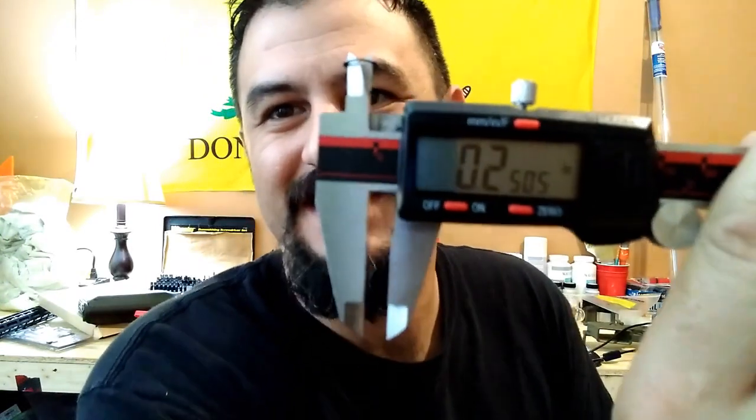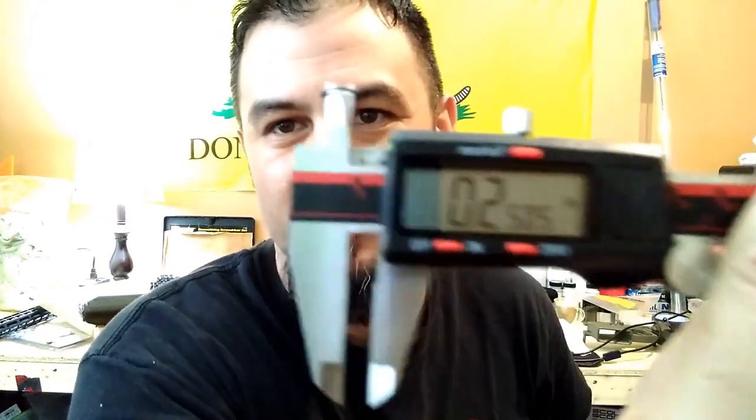They're .375, only 3/8 of an inch in diameter. Now, your inside is set up... 0.5210, or sorry, I read it backwards. That is 0.2505. If you guys see this on the camera, I'm trying to read this. This looks like 0.5202, it's actually 0.2505 on these. Sorry about that. But basically, this is going to fit 1/4 inch takedown pins. So, as you see, they slide right on. You got a nice, good fit.